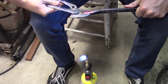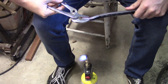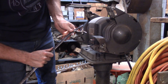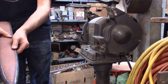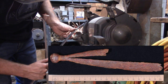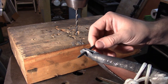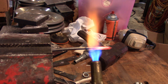With both sides conforming to the scabbard, I cut and bent a tab at the end of each to overlap in the middle. I cheated a bit and used the bench grinder to match them up. I'm deviating a little from the example anyway. It looks like both halves were just kind of smooshed together, maybe even forge welded and capped by that knobby terminal. Since I have not yet successfully forge welded anything, I'm using rivets everywhere. I'm just using bits of an annealed nail.